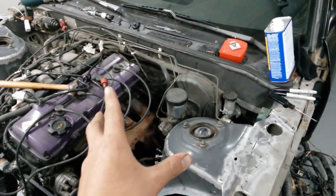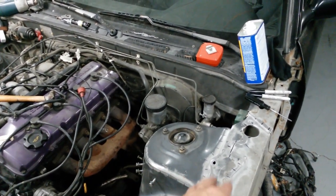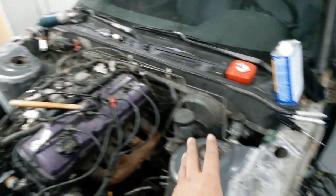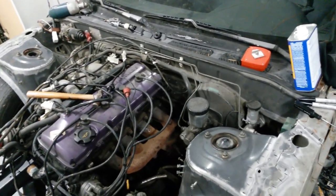Side is also marked up, and I made sure to go back and forth from one side to the other to make sure that there was an even number of welds on each shock tower and to double check the spacing. Sometimes I erased some marks just to get it even, and vice versa, back and forth doing that sort of thing. Double check the marks we make to make sure that they are identical from one side to the other, so that one side doesn't have like 40 stitch welds and the other side has 20 stitch welds because for some reason you messed up on your measurements.